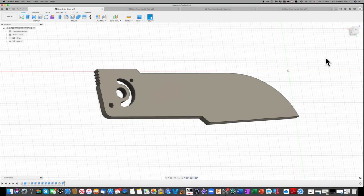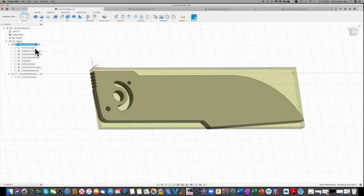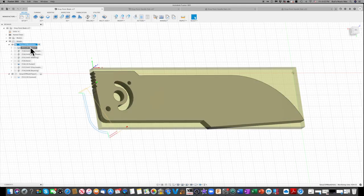Looking in Fusion, the first step was putting in the blade shape — fully digitized, went pretty smooth. What we're going to focus on machining today are the mechanical aspects of this blade: the pivot hole, the two different-size detents, the pin-stop half-moon, the finger notches for the flipper, and a little contour on the end of the blade. Profiling and bevels will be in a future video.